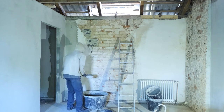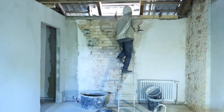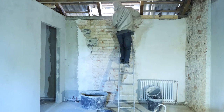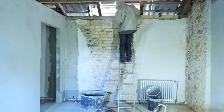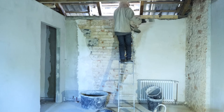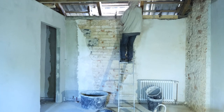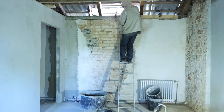After we're done mixing the concrete, we go step by step and apply it to the mold. Press it into the mold so the concrete fills all the little spots and air gaps in between. Make sure to properly wet the surfaces before you apply the concrete. After we are done filling the concrete, we wait at least two days before we remove the mold.